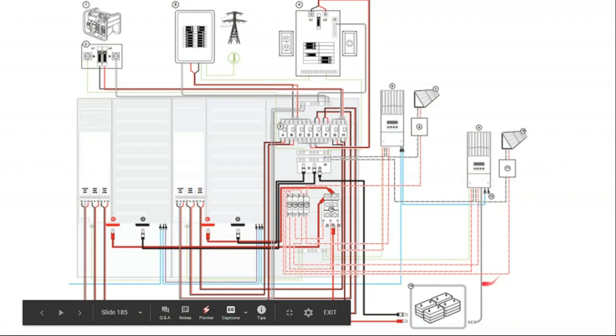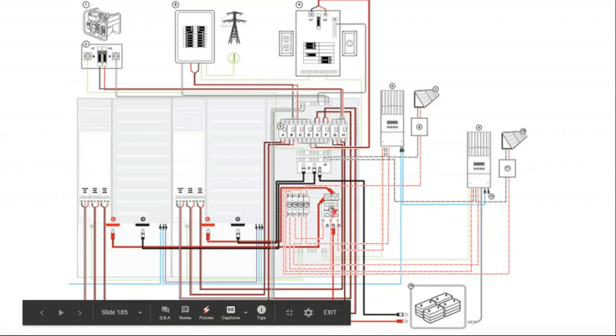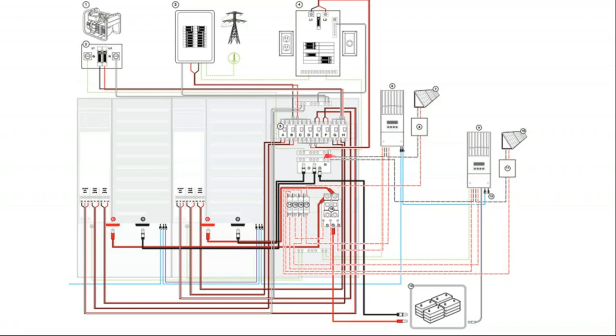So this lands on here, this lands on here. The battery bank itself is being connected to this bus bar for your negative, and then we have a fused bus bar for the positive. That's for a negatively grounded configuration. If you do a floating battery bank, then you need overcurrent protection on both ends of it. And so this is coming off the battery bank, and that means that this is a 48 volt DC bus bar, and this is a 48 volt DC bus bar.